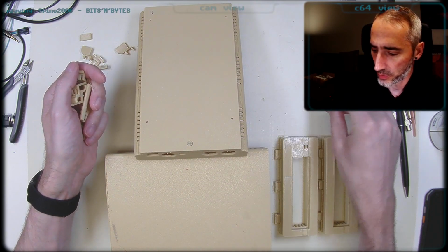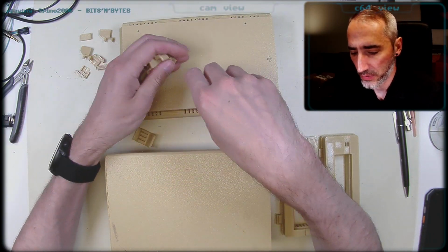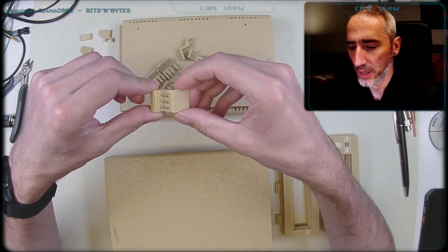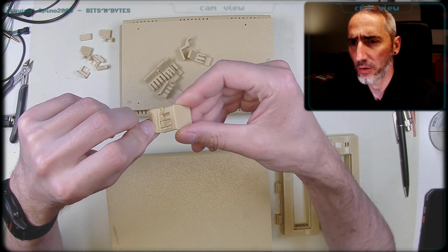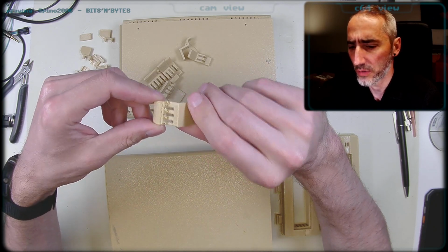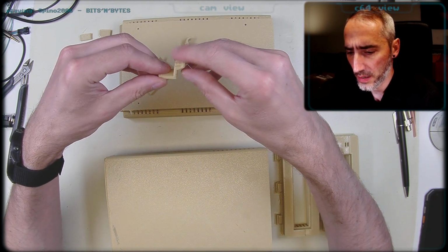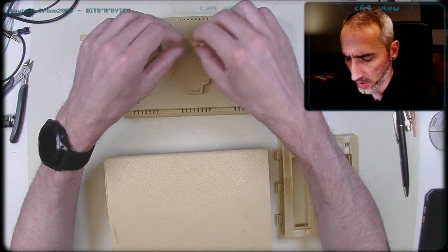In order to improve the print quality, I sliced out a part of the bottom case and did some test printing with different nozzles, different printing settings, with or without support. And as you can see, without support it isn't working at all. So this was some sort of unusable. Same here.